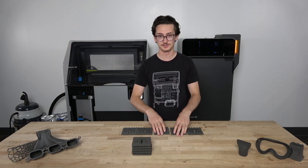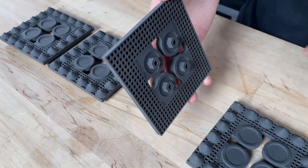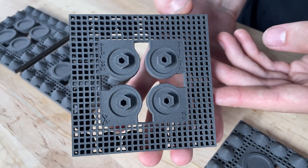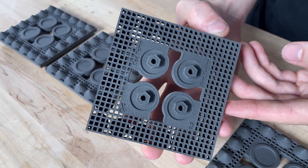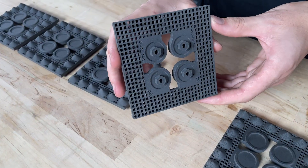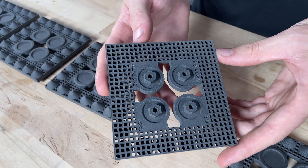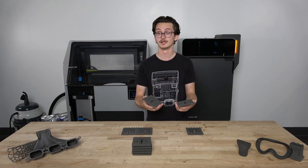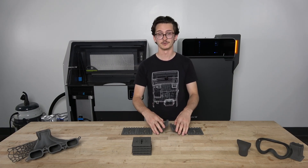To confirm my choice of bed temperature adjustment, I will look at the grid side of both plaques. For 0°C, there is no obvious pitting and very mild dimpling on the grid. The same is true for the minus 1°C plaque. Therefore, minus 0.5°C in between these two is also not too hot and should be the correct bed temperature adjustment.